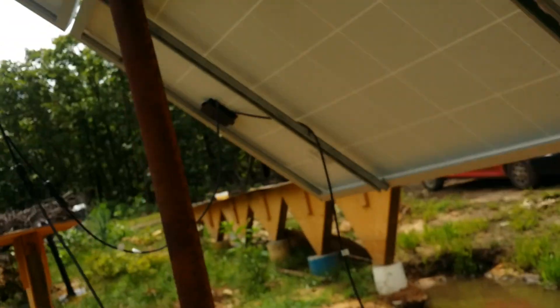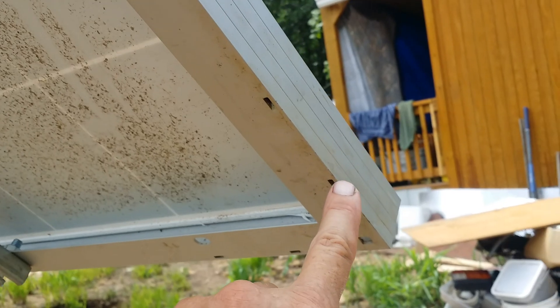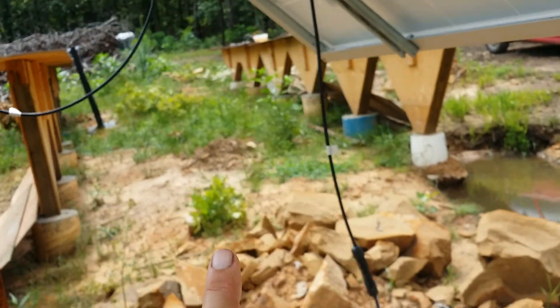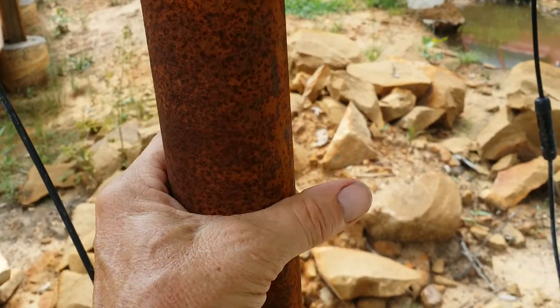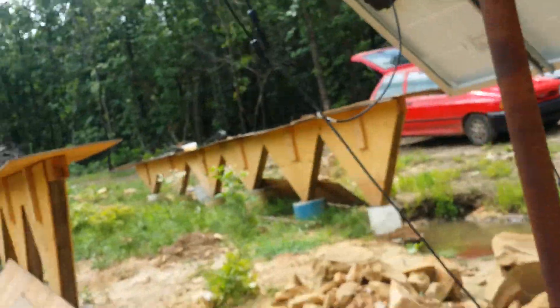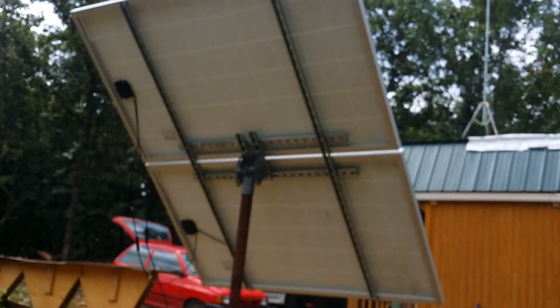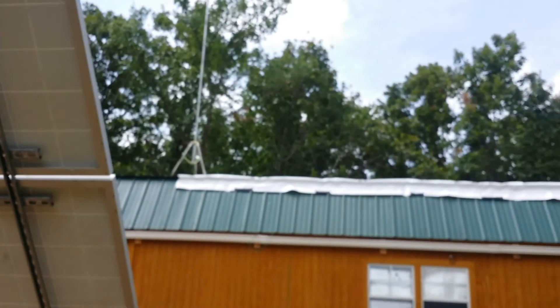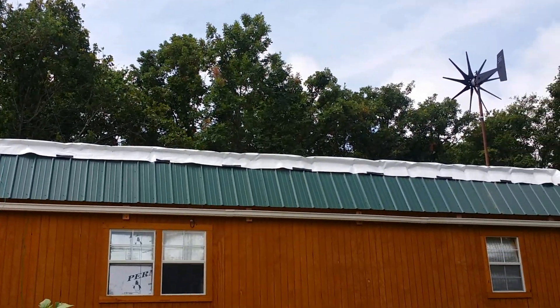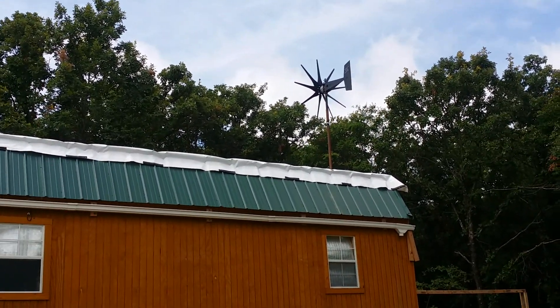It seems like a pretty good mount. We come out here daily — we don't have a tracker — and we just take our one finger and move it like this. See, I just moved it with my hand to where I want it. Bad part about it is when a big wind comes, it could spin it around. There are no lower mounts here. I'm going to put some Unistruts, drill some Unistruts on some kind of a mount and bring it over to the pole with a round clamp — two of them — and just hope that major winds won't blow it all over the place.